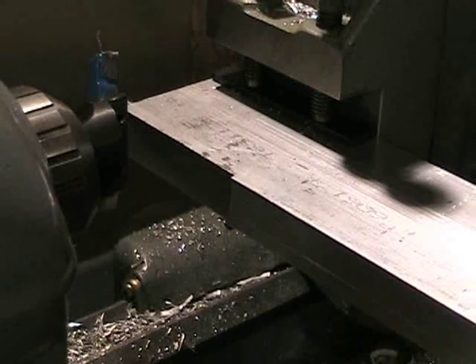At this point we have the curves gouged out of the bar at both ends, which will form the radius of curvature of the outside of the scope, and the mount holes will be there. Now what we have to do is remove the excess material and take it down below that level, then bevel the edges to make it into a dovetail. To get the bevel, I've put a wedge in the jaws of the milling attachment so that the piece is held at a 15-degree tilt from horizontal, and then I'm using a fly cutter to take the bevel off the sides. It gives me a nice clean straight line.